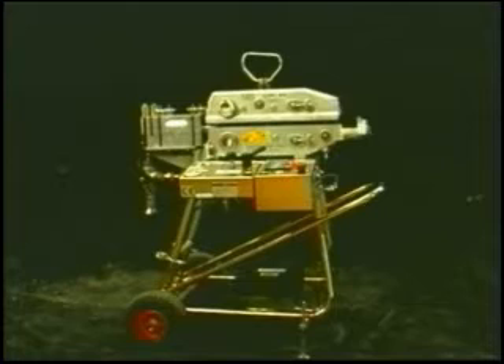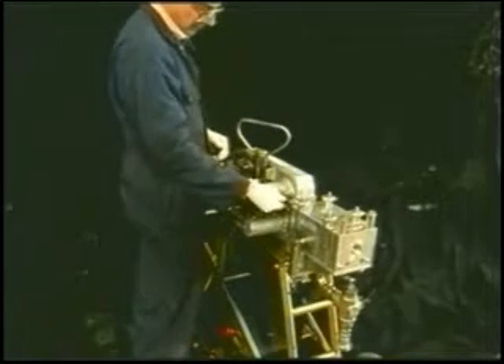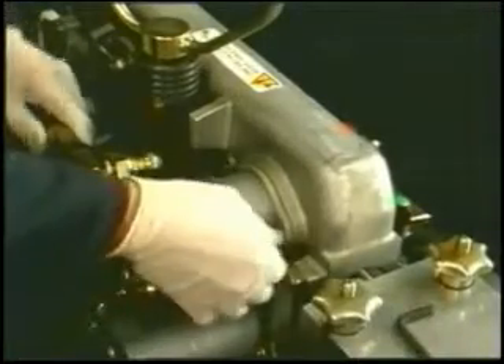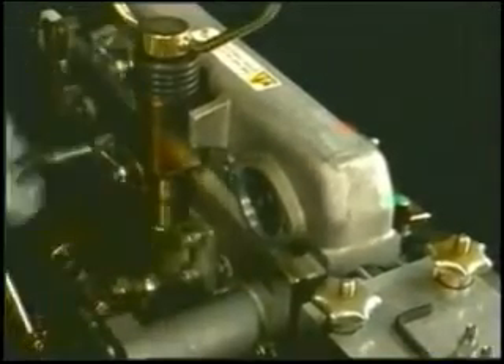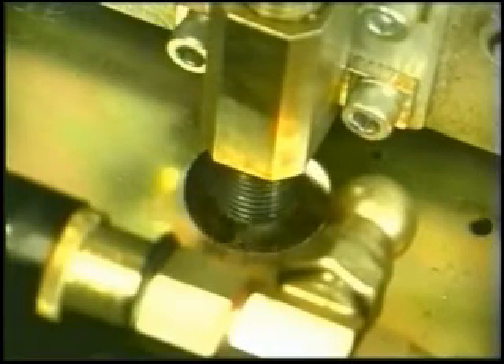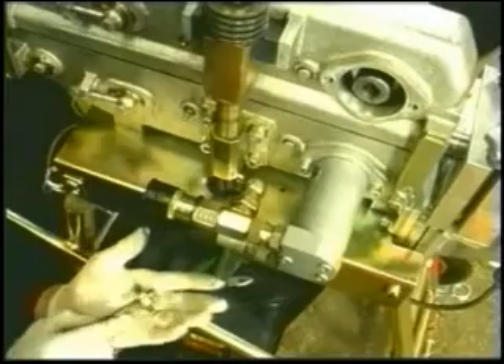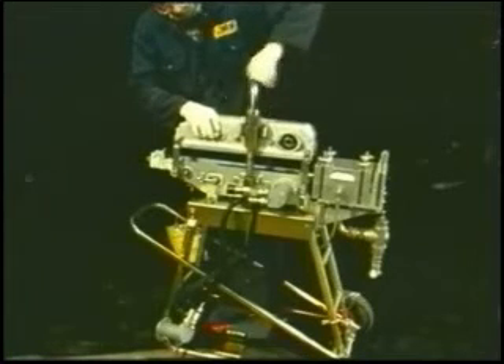The following procedure can be used for replacing either the top or bottom chains of the pusher unit on the blowing machine. Disconnect the hydraulic motor fixing bolts with the six millimetre Allen key. Next, remove the stop washer from the base of the main clamping screw using the same six millimetre Allen key. This will allow you to completely undo the main clamping screw and separate the top and bottom halves of the pusher unit.